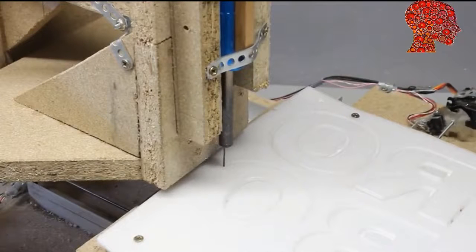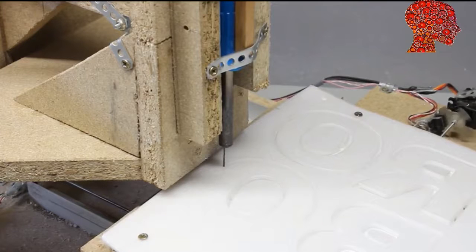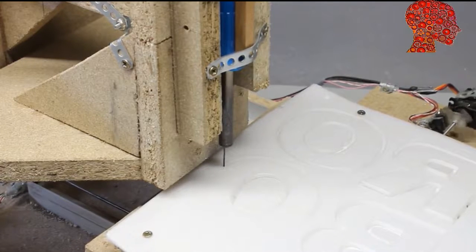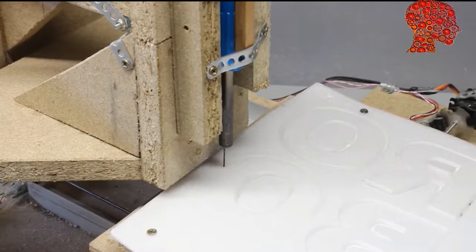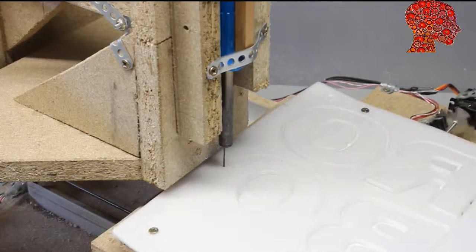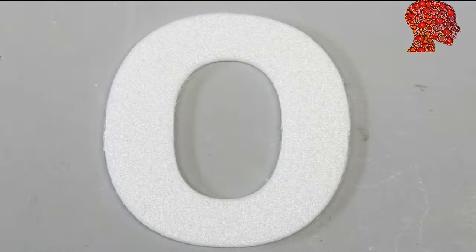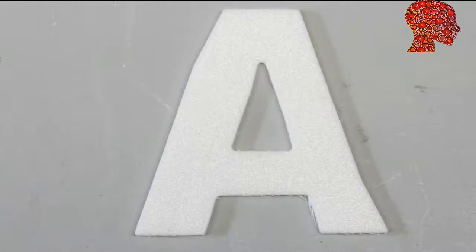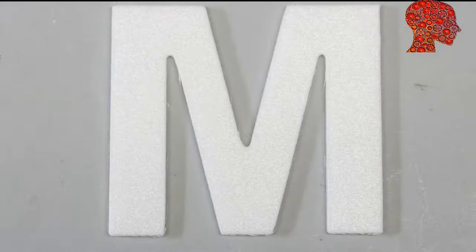The width of the cutting line is approximately 2mm and there is almost no side load on the tip of the soldering iron. Depron is cheaply available and it is a proper material to demonstrate how a CNC machine works. The machine is meant to be an educational tool for learning how to do computer numerical control, it's not a production tool.